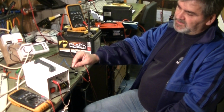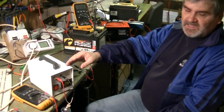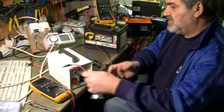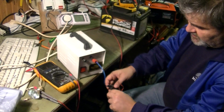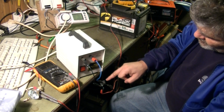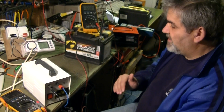If we have a triangle waveform, then the maximum is the effective value, let's say 10 volts, times the square root of 3, which is about 17 volts, 17.30. Over here it is over 14 volts. So if we apply it, it is so simple, just put a bridge rectifier on the output of the transformer, but you should calculate the voltage drop on the diodes: the maximum peak minus the voltage drop on the diode will give you the maximum voltage peak.